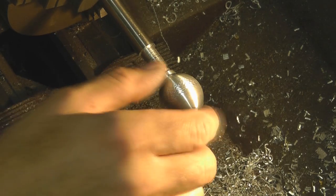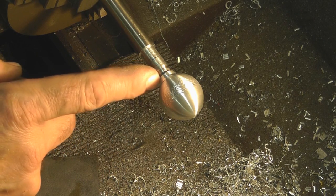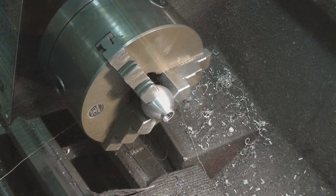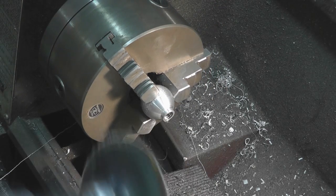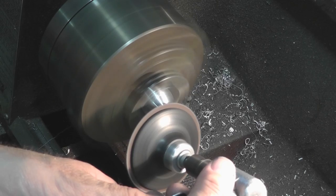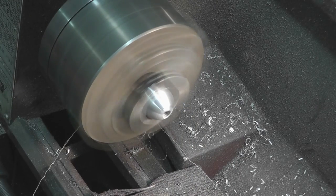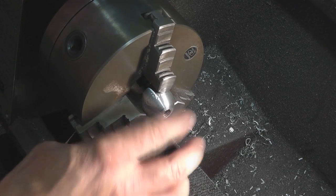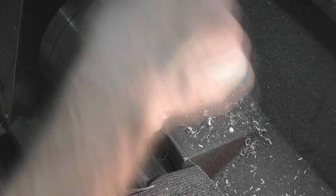Since we're at 1.090, we'll take our mandrel out of the chuck, turn it around, put the ball in, clamp it down, and we'll just face off this little bit of aluminum that's sticking out. The best way to do this and try to save as much of the profile as we can is to use a sanding disc on my 90-degree grinder. I think that's good enough — now let's see how it fits in our mold halves.